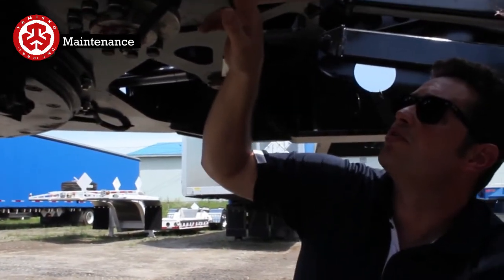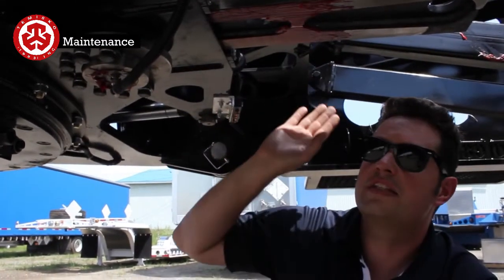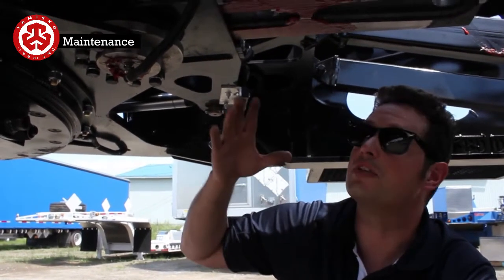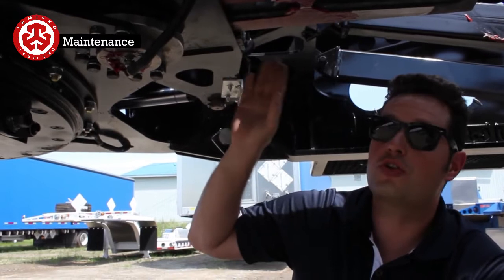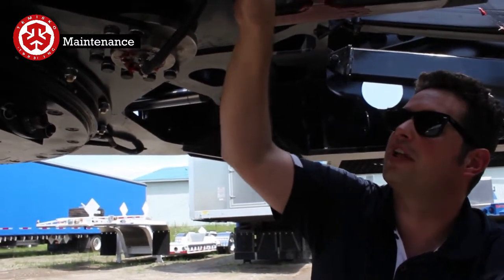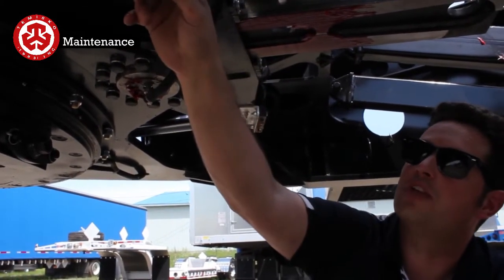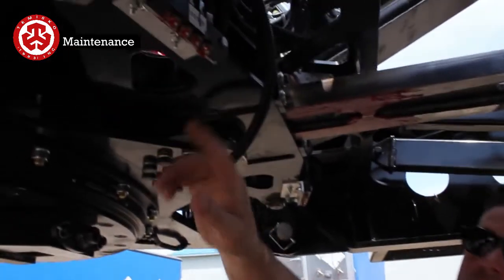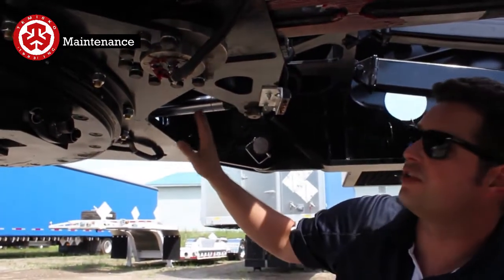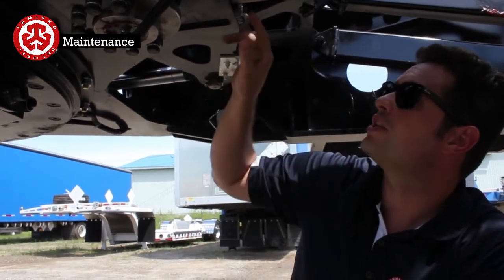In here, there are these brass slides on each side of this big rod. This is the most critical part about the whole system as far as keeping it greased. Whenever these slides aren't greased, sometimes they'll even stick and pop these bolts off, like this. So it's very important to come in here and grease. There's a grease bank here that greases all of this, and another grease bank just on top of the corner that greases all of the cylinders, because there's too much stuff on top, so we need to route them here. So very important to keep these happy.